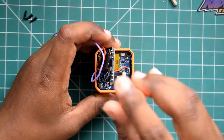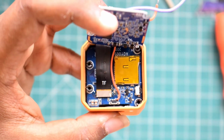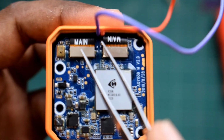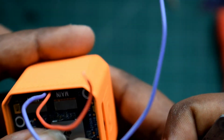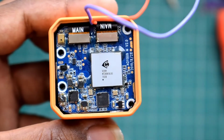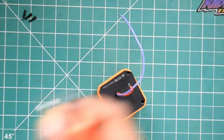Now tighten up the screws of the second PCB board and close the top PCB board. Make sure to run the wires in between the 2 flex cables. Press it down carefully, and then run the wires through the back plate and screw them on.